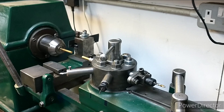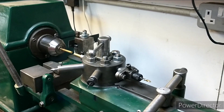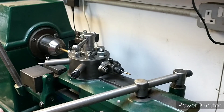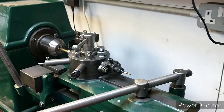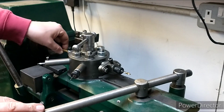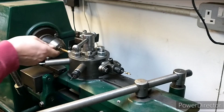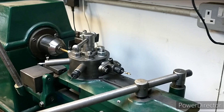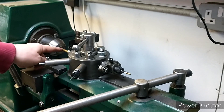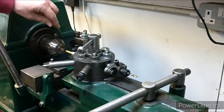I'll give you a quick demonstration of how it would work. The first tool you use is an end stop — you pull this forwards. There are limits on the far end of this sliding piece. You pull your stock up to that end stop and then use the locking lever at the back to lock the collet, so that distance is accurately controlled by the end stop.